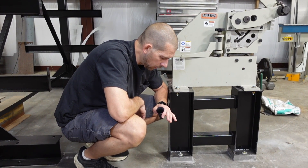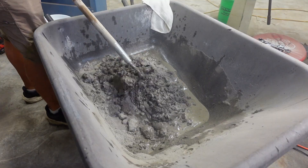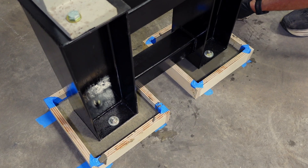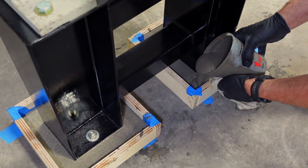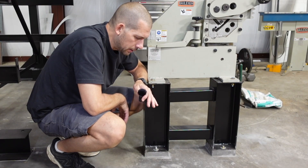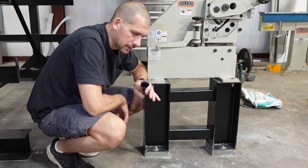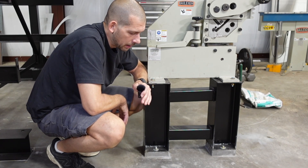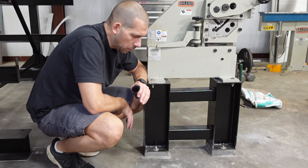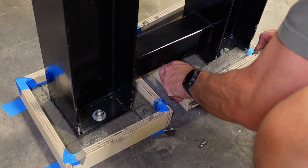The bag of grout does have an amount of water that you're supposed to use on the bag, and I used close to the maximum — I probably could have used just a little bit less. Concrete goes from dry to real wet real quick. The bag also said to mix the entire bag, and I assume that's because it has some additives to make it non-shrink. To ensure it has all the right components, you need to mix the whole bag so that you know it's going to still have the same properties.